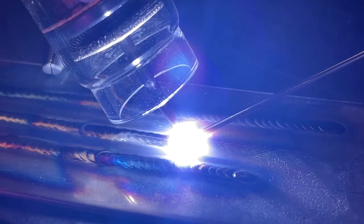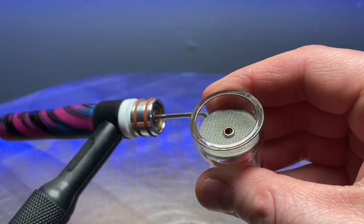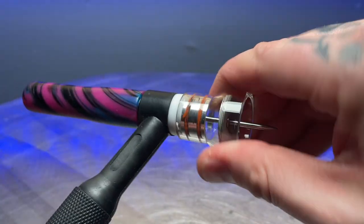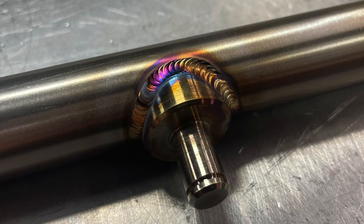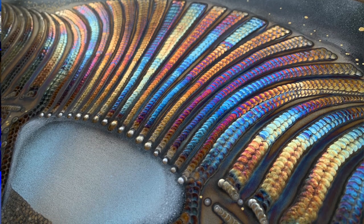Getting colors on your stainless steel TIG welds is a lot of fun. It looks awesome and I've learned some pretty crafty ways of getting the best results over the years. What causes the colors to happen? Essentially, the easiest way to describe this is it's a reaction with the weld area itself with the atmosphere that we breathe, forming a light oxide on the weld surface.